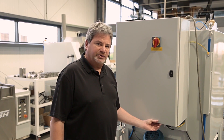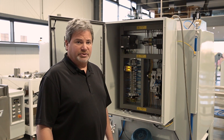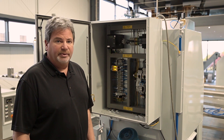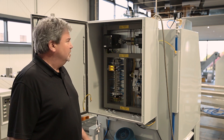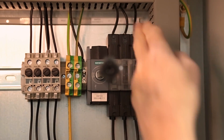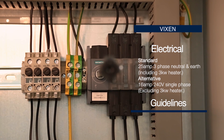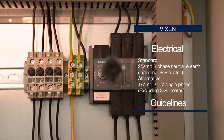Our next video will show the electrical connection to the Vixen. We supply all different voltages, so any single phase or three phase voltage — your machine will be configured for your specific area. We highly recommend that you use your electrician and follow your codes in your building as well as your local codes. We brought our power in the upper right-hand corner of the control panel, where you have your on/off switch. You can see the three phases of the three-phase power connected right here, and we bring our ground connection over and ground that as well. It's very important that the machine be phased properly — that's crucial for the pump rotation. We don't want to spin it backwards and unscrew the impeller.